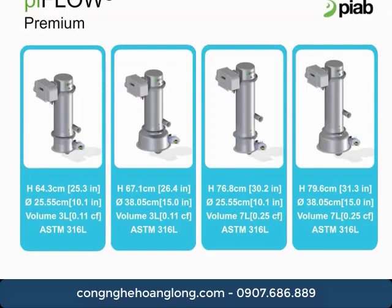The next range of piFLOW vacuum conveyors includes the 3 liter and 7 liter unit. These conveyors can accommodate longer filters and larger vacuum pumps, which will allow us to increase the transfer capability of the Piab receiver. The bottom valve can also be a full open discharge, which is used for non-free-flowing product, or our standard conical discharge, which is used for free-flowing material.